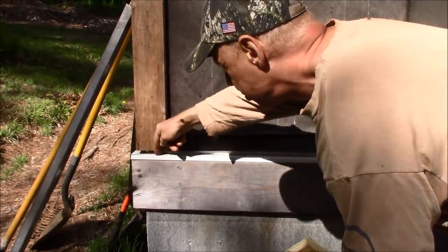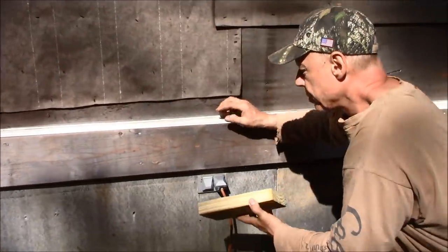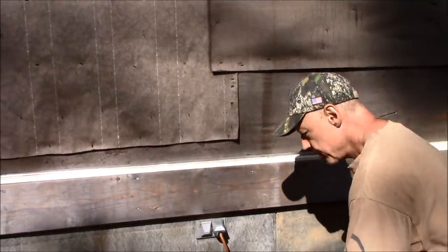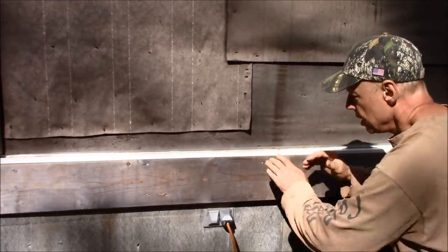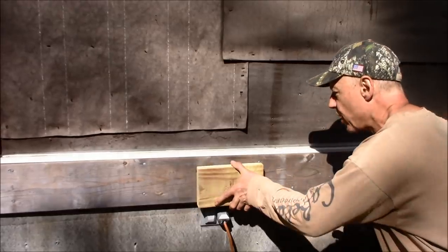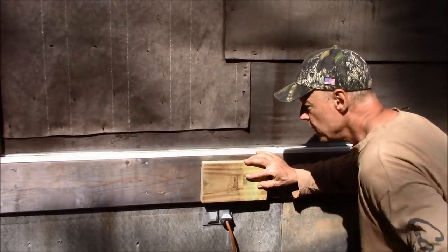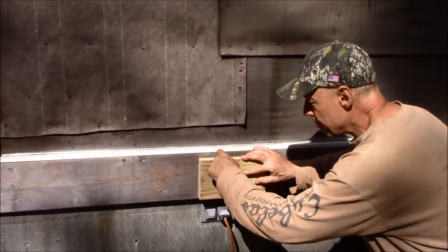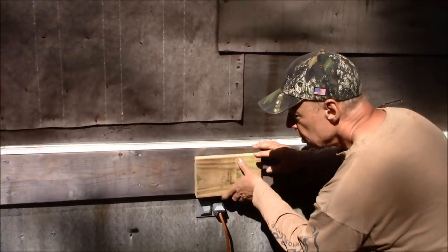And then it would be pulled up the end grain like a wick. So before I nail this on, I'm going to slip a flashing up under this. Then I will nail this to the flashing with my nails angling downward, so no water that might get in there would get into the holes. So that's what I'm going to do.